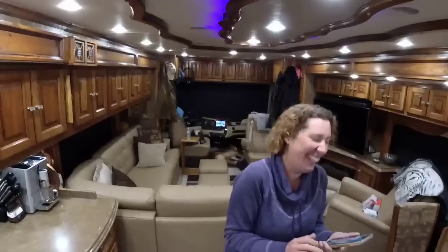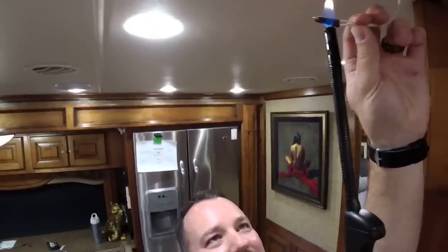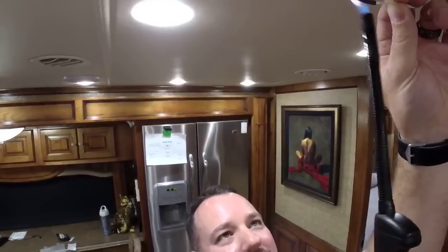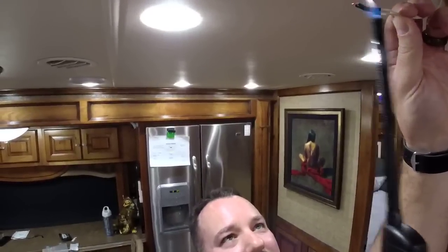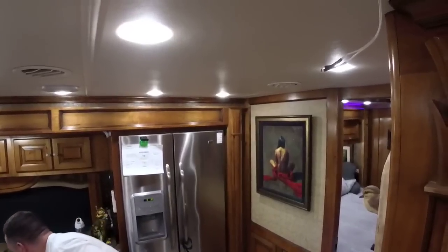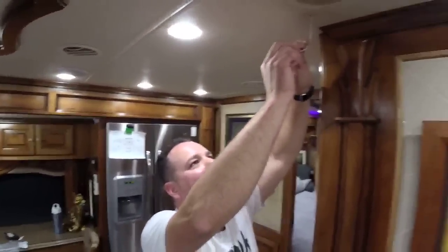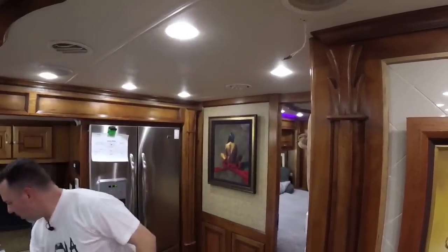All right, now we're gonna melt some heat shrink. More in the blue flame only, please. Thank you. You're welcome. This, again, is just to protect these wires, even though this giant heat shrink has to go back through a little hole. Don't break the thermistor. Don't overheat it either, because you'll break the thermistor that way, too. Yep, you definitely will. And now we're going to let it cool just a little bit, because otherwise it's gooey, and we're not going to play with gooey. We'll just leave that there for now, for just a moment.